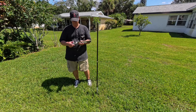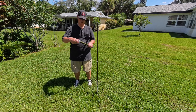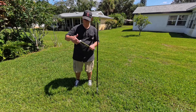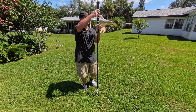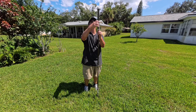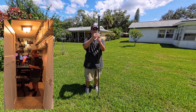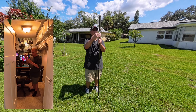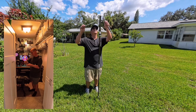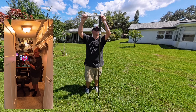The ground spike and the two single extensions are already installed. I did put the radial puck on, but I didn't use it — I have very cooperative ground here in Tampa Bay. I never have any issues with SWR, so I'm a bit spoiled. I don't have the ground spike pushed all the way into the ground, so I can pick up a couple more inches in height. By the time I was done with my installation, I was right at six feet tall.